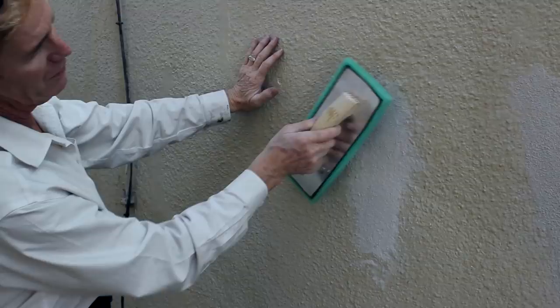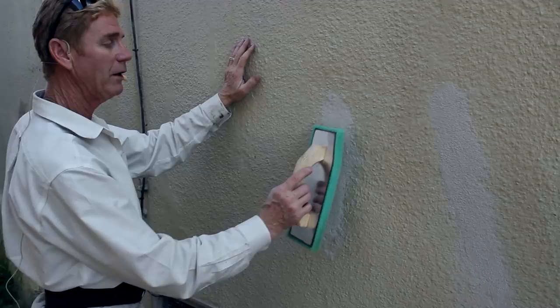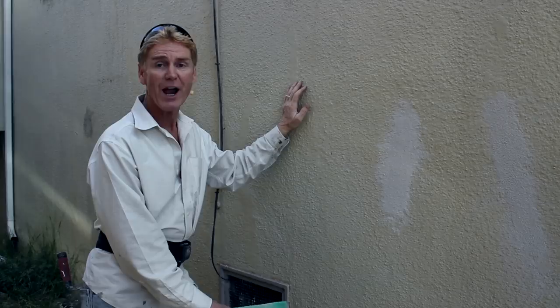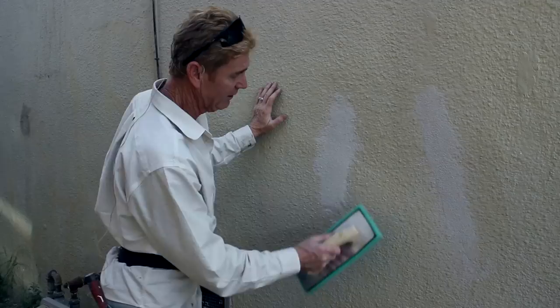There you have it - now it's a sandy finish. Does it match perfectly? No. Is there a way to match it perfectly? Sure, but it's twenty times more difficult because you have to put Weldcrete and throw on a dash finish. Anyway, I'm showing you another way to repair cracks. This fella asked how long it would take, and I said it'll take possibly four eight-hour days because you're going to do this to every single crack. If it's too smooth, put some more on it and put more water on your float and just float over it again. He tried it on the other side and it came out pretty good for a first timer.